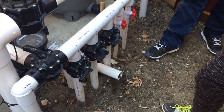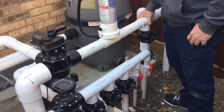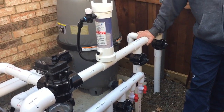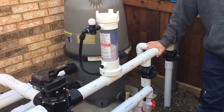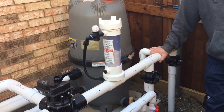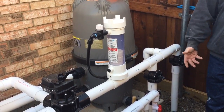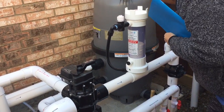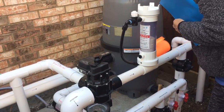That's your backwash line, in case you ever have a backwash filter — a DE filter or a sand filter. DE filters provide the best filtration, filtering down to about one micron, which is about the width of a hair. Cartridge filters can do anywhere from two and a half to three microns — not really that much of a difference. And right here where it says clean and dirty, that's how you know it's getting time to service the filter.